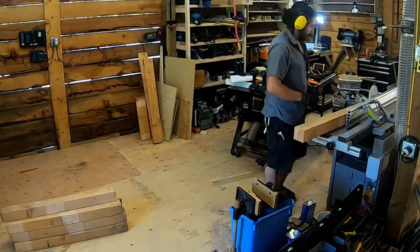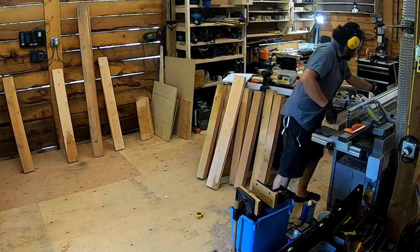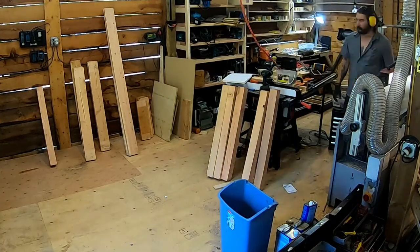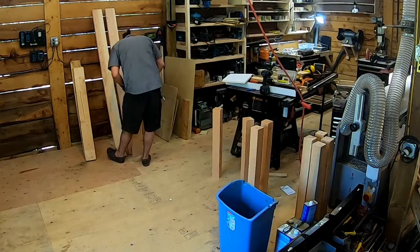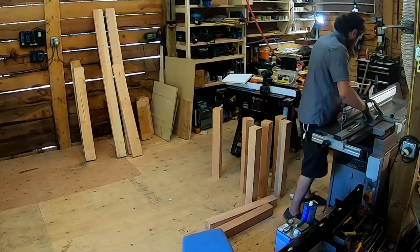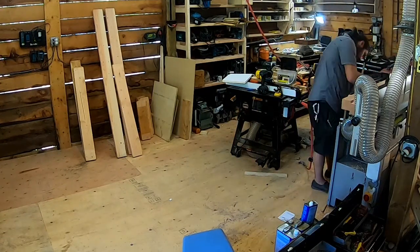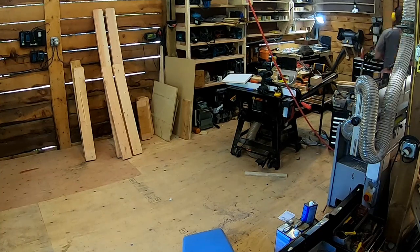Once all the wood was disassembled and I checked everything for nails, I milled it all square and cleaned up all the surfaces. I figured out what I was going to do — basically reusing all of these four-by-four pieces to make double-thick legs that would hold up a more or less laminated top and some shelves underneath, reusing as much wood and scrap from building out the shop as possible so it wasn't a very expensive project.